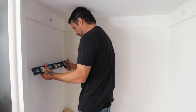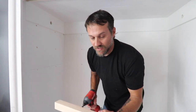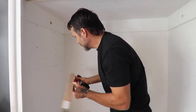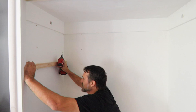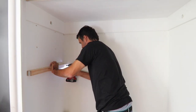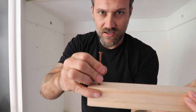I'm just going to check the line, make sure it's level. Then I'll use my spiral bit on the square block and drill in my countersink holes. Now I'll take my long three-inch screws, put them in their little holes, starting with my finger, and fasten it down.